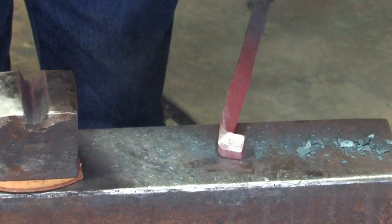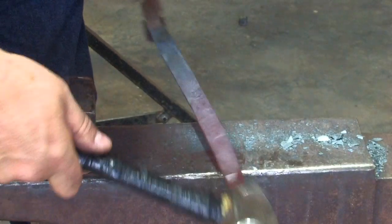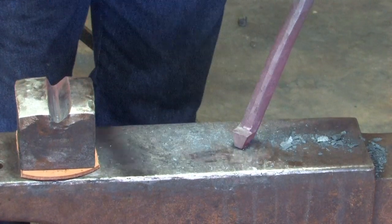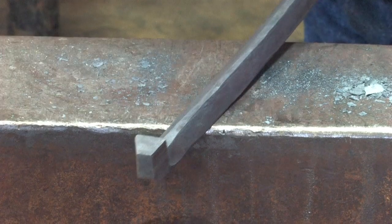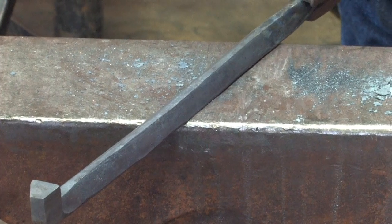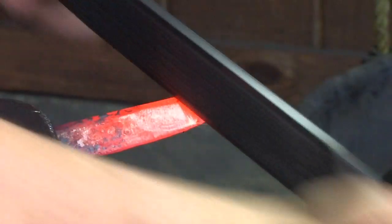We don't have too much rasping to do. Put it over the edge, just tip it. So you work the whole front of the heel caulk. What we're going to do next is rasp the heel caulk, and then we're going to mark the center of the toe. We want the outside about 8 to 10 mil longer than the inside. Trying to capture the shape of the heel caulk that we've been asked to make.